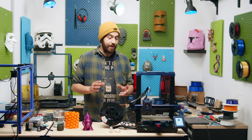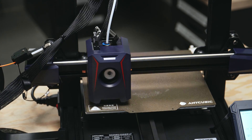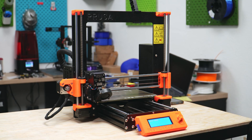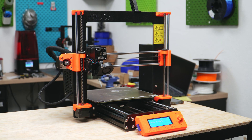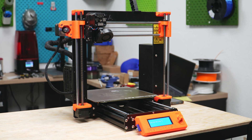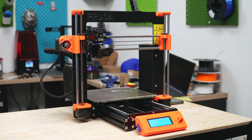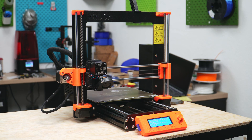The ABL is really nice, and this printer has 25-point leveling. The time for a full pass over the bed is about average, but what is really interesting is that it has no leveling wheels at the bottom. Prusa did this years ago with the Mk3, but it hasn't been implemented into many other printers, let alone budget printers. With dual Z motors operated independently, each side can be trammed automatically — and if you have a very rigid bed, that's basically all you need to ensure the gantry and bed are totally parallel. Any other small variations in distance are picked up by the auto-leveling.